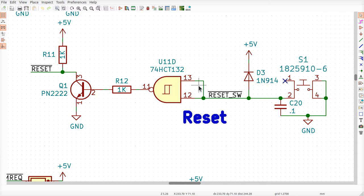Okay, so what that really means is, if this capacitor starts charging up slowly, relatively speaking, and it kind of is going up and down, it's not charging perfectly, right? Maybe it's got some noise in here, and it will, because the 5-volt power won't be perfectly smooth, and that's the problem, right? The 5-volt power will be glitching up and down, and all the gates are transitioning and stuff. There'll be a little bit of noise on that. And the last thing you want when you're having a nice, small, slow, smooth charging curve is to put little saw teeth in it like this, okay? And that's what will happen otherwise.